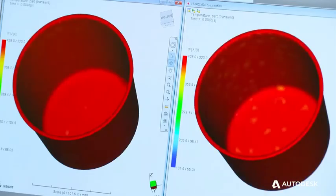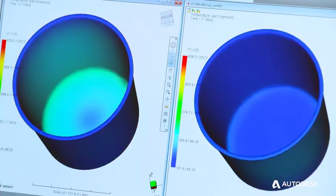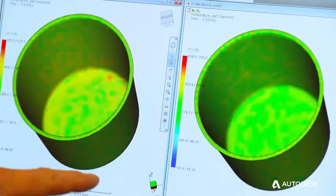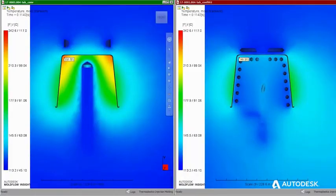So what we did was we ran analysis on their existing water configuration. We implemented conformal cooling channels inside this dome here, and then what we were able to do was reduce their cycle by almost 25% by reducing their cooling portion. The cost to convert two tools over to conformal cooling was less than half the price than it would have been to add one new tool to their capacity. Not to mention the extra floor space they would have required, the man hours and things like that.